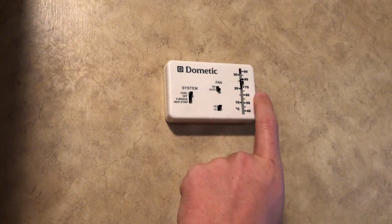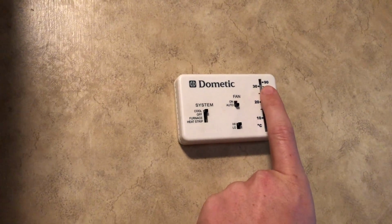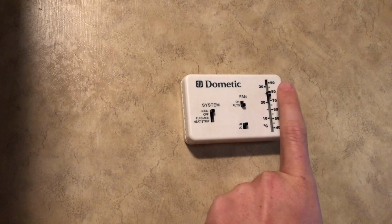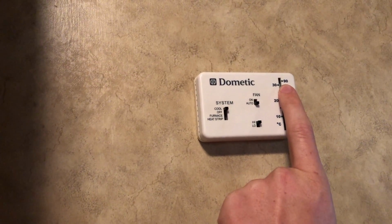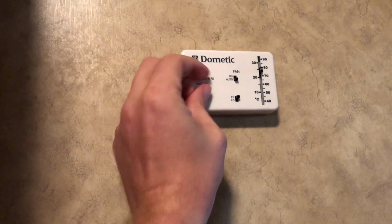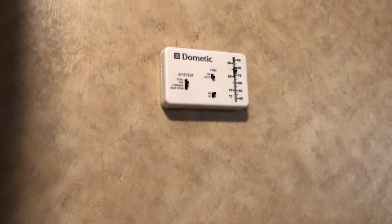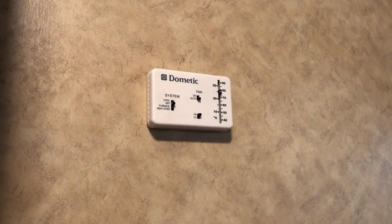Check this out. The slide for your temperature, I'm going to just push in on it a little bit. Now I'll release it, comes right back on. Push in, shuts off. So there's the problem. It's in the temperature slide. So what I'm going to do is go ahead and replace that and see if that doesn't take care of the problem.